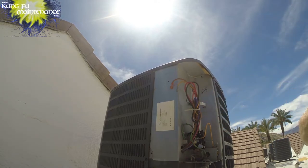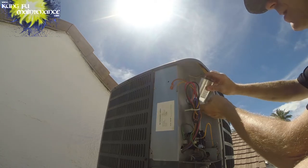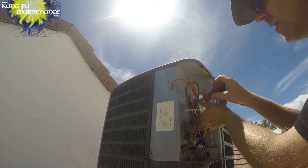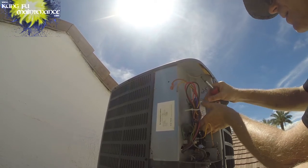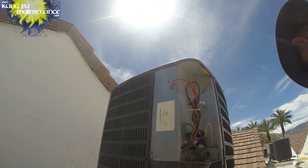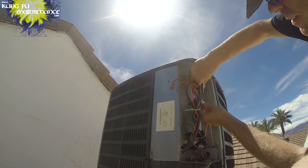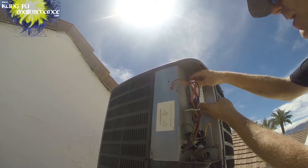Here's a 40/5 new one on Titan Pro. I also like hard start kits. It's another school of thought. A lot of guys do not like hard start kits. On some of the premium air conditioner units, they come with hard start kits installed. You see them on Yorks. My opinion is it minimizes the stress on the unit. So this one's got a little bit different profile. You can change the screw hole. Sometimes I'll just take this and give it a little bit of a twist, because I need a place for the hard start kit anyway.